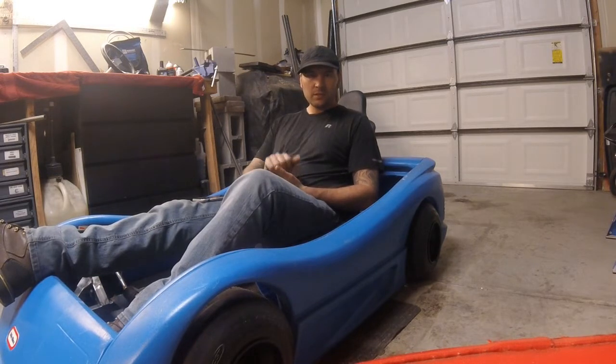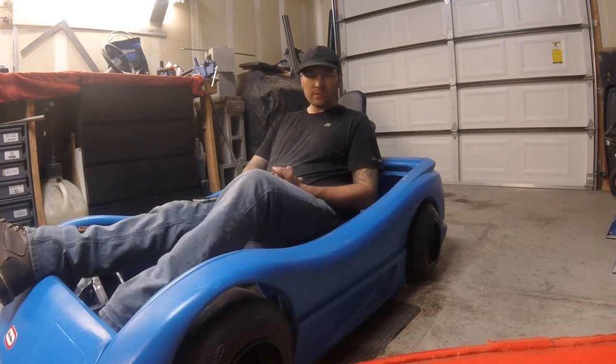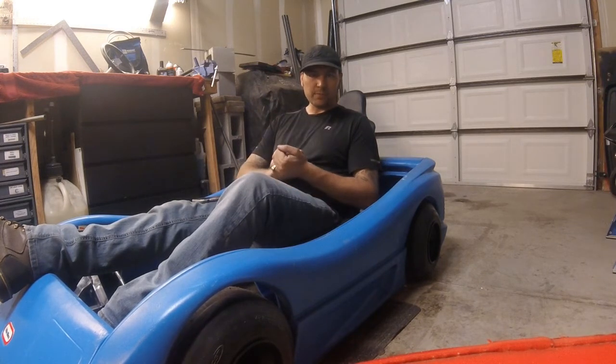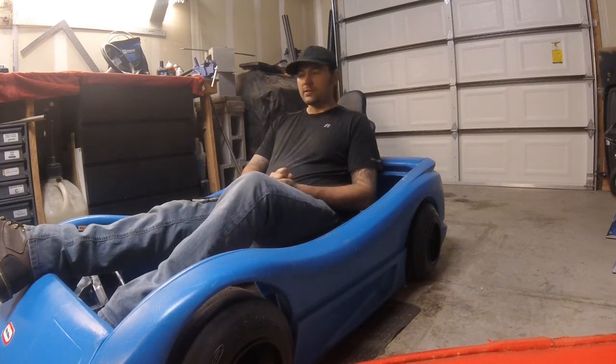For those of you that were following the Banshee build, I know I keep saying that we're going to have a video of it riding, and honestly, the motor just doesn't run right. I always knew that the compression was a little bit low, but that little short kickstarter is pretty deceiving when you're kicking it over. So I finally did a compression test. It's just shot. So tomorrow I'm going to pull the top end off of it. We'll get a piston ordered for it, get the top end rebuilt, and then we will get a video done with some good riding. So just be patient with me. I'll get it out there.